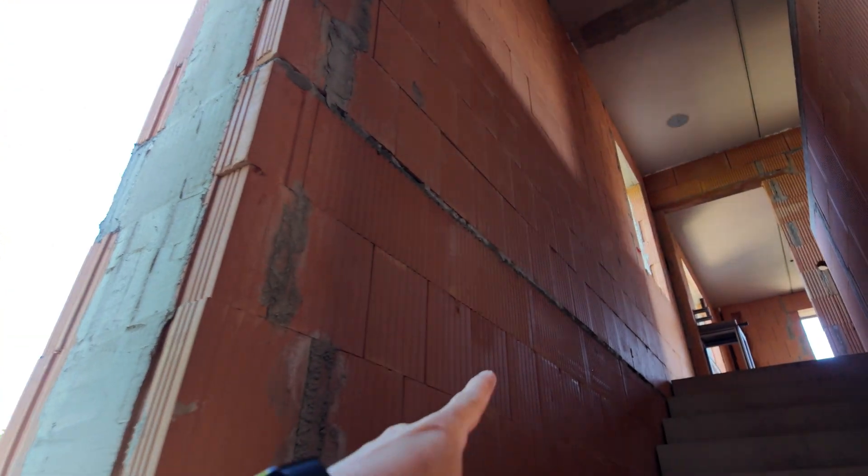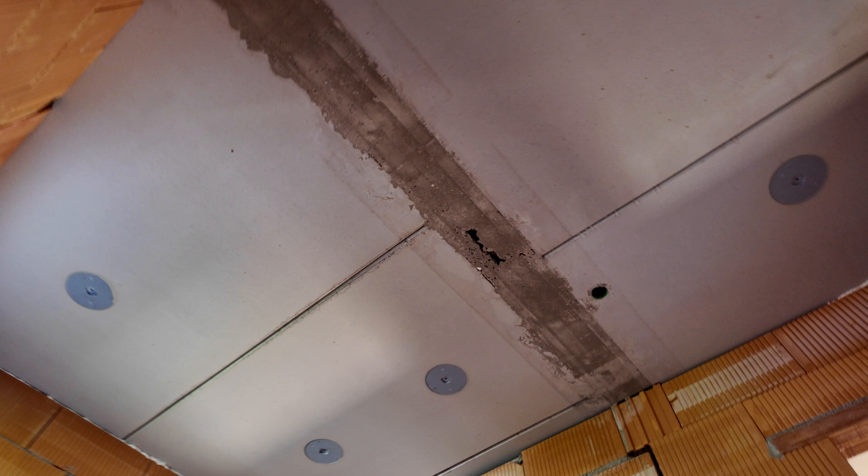Upstairs, where you hold your hand on the railing there will be LED strip. In addition there will be wall lights mounted here as well, and here in the hallway we have some more spots. It's a super cheap solution with 24 volt dimmable spots because we can have four channels, one white dimmable, on an 80 dollar dimmer. There's a link to a more detailed video up here.